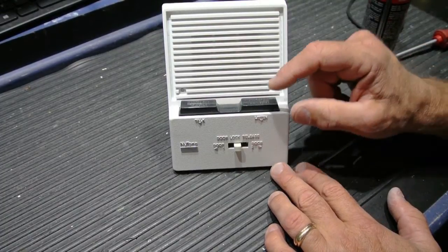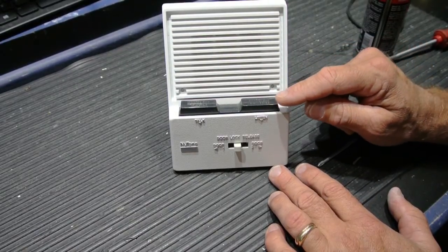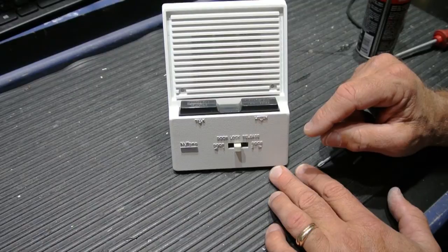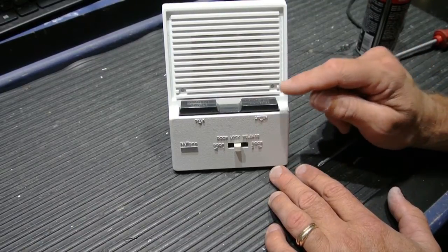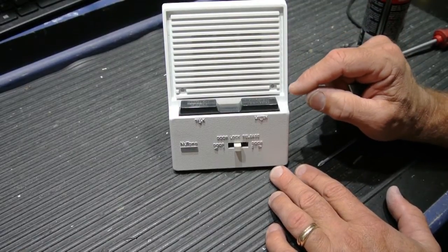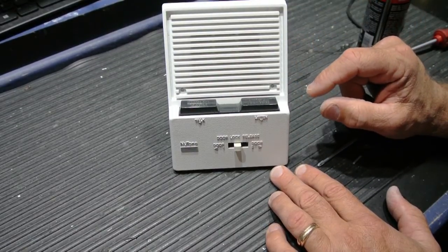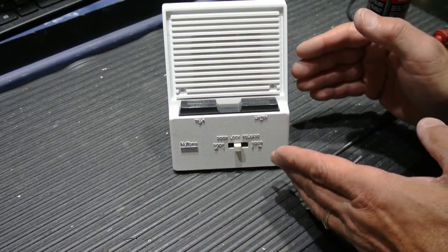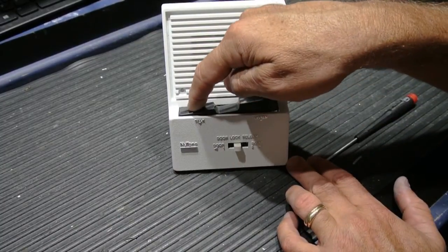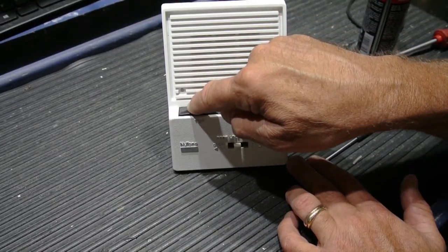If you had a building with one speaker in the entire building and it had some added resistance in the switch because it was dirty, it really wouldn't cause a problem because it's only one switch with a little bit of extra resistance. But if you have a building that has 45 speakers and each speaker has a little bit of added resistance because of dirty switches, and you add up all of those little bits of added resistance, it's enough to throw the system out of alignment, and it sees too much resistance and it acts as if someone is pushing the button down all the time. And that's what causes most problems on apartment house intercom systems.